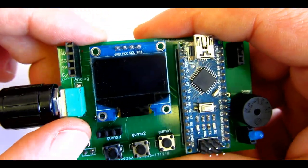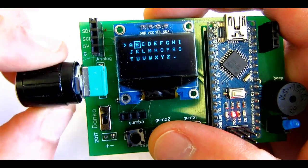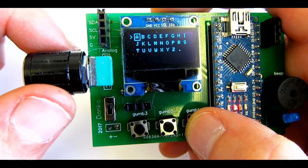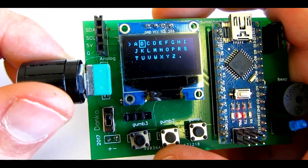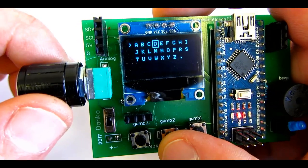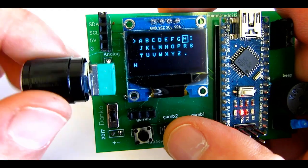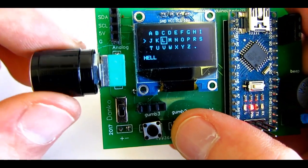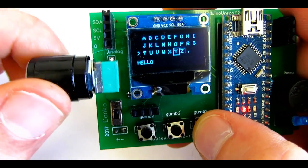This is the virtual keyboard I created for Multidruino. Letters are placed in three lines. You can choose a letter in a line using a potentiometer. You can change a line by pressing the right button on the device. You can select a letter with the middle button, and when you are finished you need to press the first or left button.